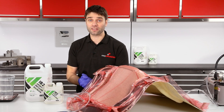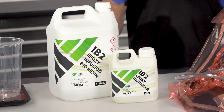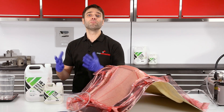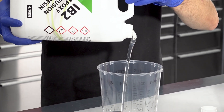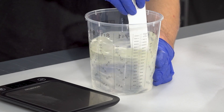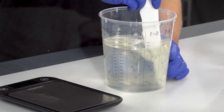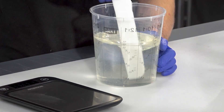We're now ready to mix the epoxy. Although we could use any infusion epoxy, we're going to use the IB2 bioresin. This doesn't compromise on performance over a traditional epoxy resin — it's just that some of the constituent chemicals are derived from plants rather than petrochemicals — so it's clearly very well suited to working with sustainable flax reinforcements. As with any epoxy, the IB2 needs to be accurately weighed out at the correct ratio and thoroughly mixed for several minutes. When calculating the amount of resin needed for a flax infusion it will be more than you're familiar with from carbon and glass. Typically you're aiming for a ratio of around 33% fibre to 66% resin — so whatever weight you have in fibre, double that for the resin amount.